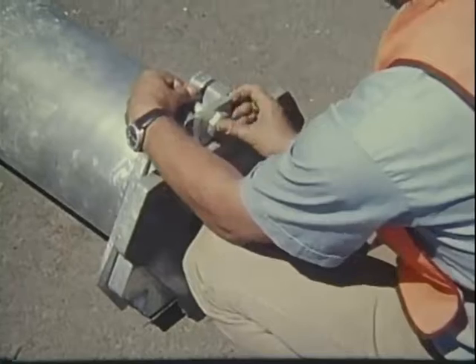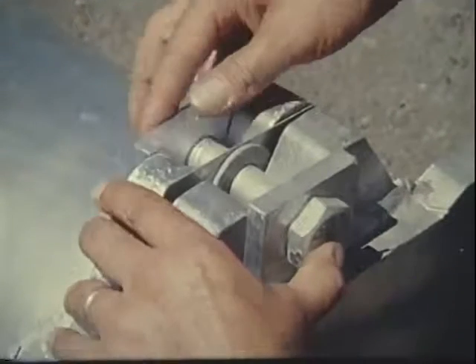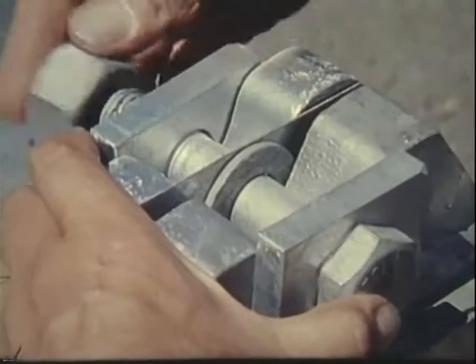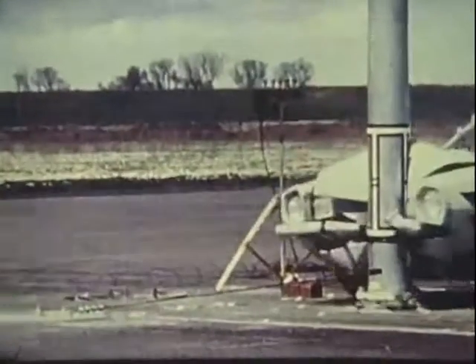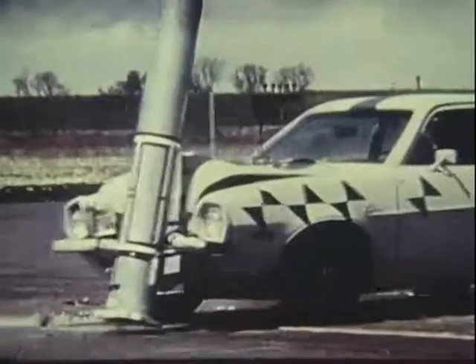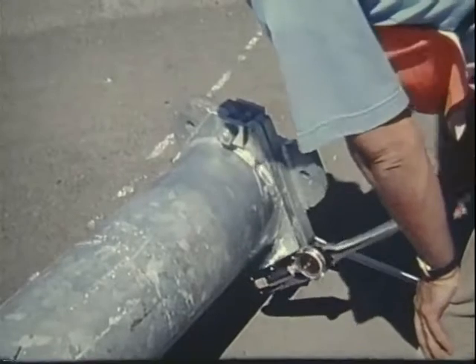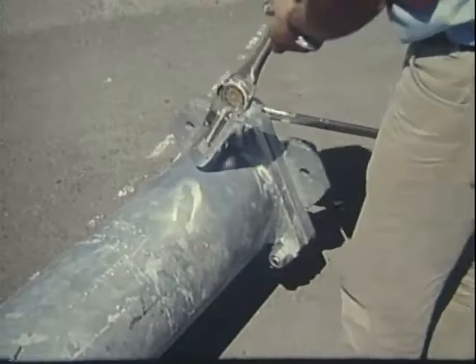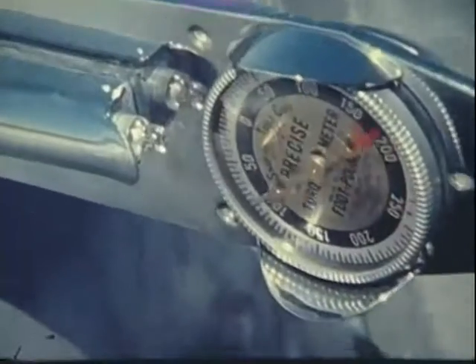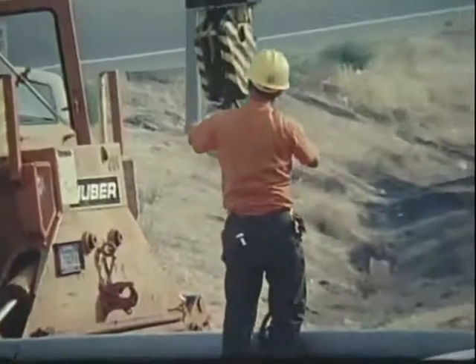After assembly, a check should be made to ensure that the flat washers are placed below the keeper plate and have not been left out. These three round flat washers provide clearance between the two slip base plates so that if the lighting standard is impacted, the top slip base plate will slide easily. Each of the three slip base clamping bolts should be installed as deeply as possible into the V notches of both slip base plates and first be tightened enough to hold the base together. The final tightening of each clamping bolt should be done in two stages until the proper torque has been reached. This Type 31 lighting standard requires 150 foot-pounds of torque on each of the three clamping bolts.